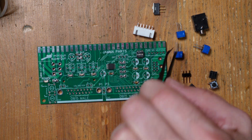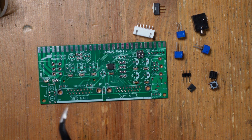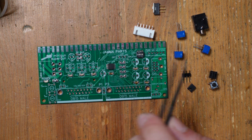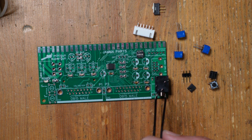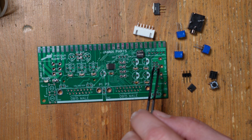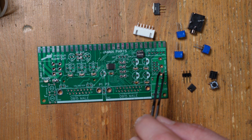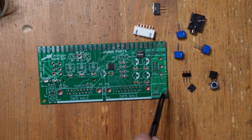We've got these 3 potentiometers. These are going to be used to adjust the balance, the intensity of the colors, so red, green, and blue. I'll show you guys that once the system is fully assembled. We've also got a stereo headphone jack over here, which is going to go right there. That's just an additional breakout for the audio. So the audio is going to be going into this 8-pin mini DIN jack in addition to the video, but this just gives us a separate breakout for sound if we need it.